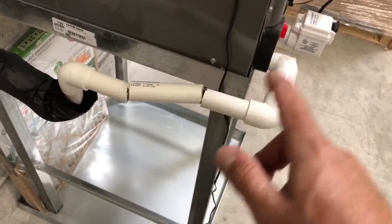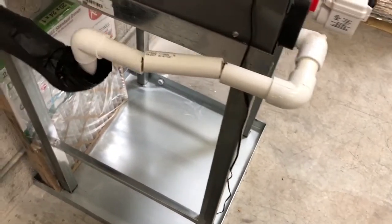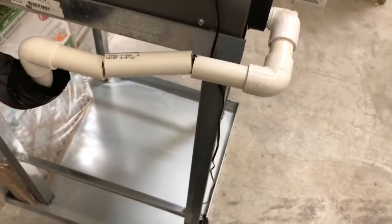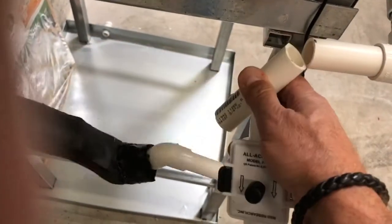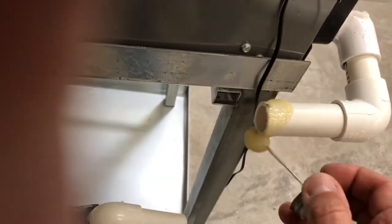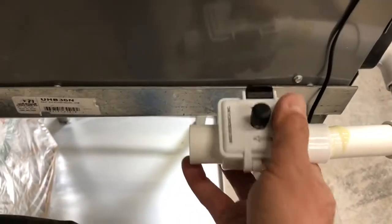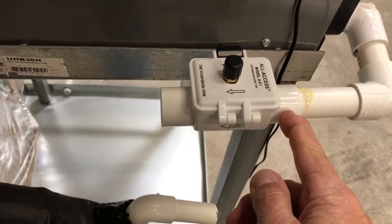You want to locate an area close to the unit where it comes out of the drain line. Then we take our PVC cutters and cut out a section of the pipe to fit the AA-1 clean-out in, which I already did. Now we take a little PVC glue, put it right along the pipe here, and push on our AA-1 clean-out device — doesn't have to go in too far, just maybe a half an inch.